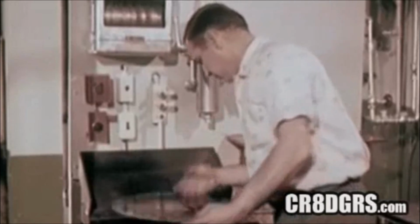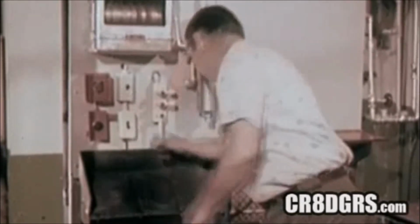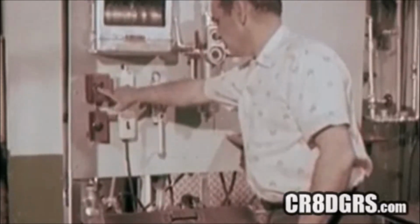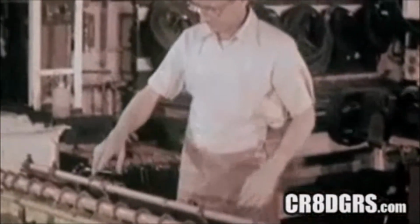Now we proceed to make metal copies from the lacquer master. The first step, silvering. This takes precisely 2 minutes and 40 seconds. And the lacquer master comes out with a new face. Now, by patient electroplating, we add a series of metallic deposits, one behind the other.